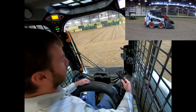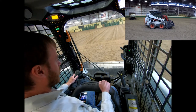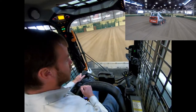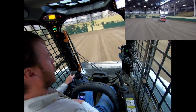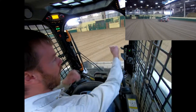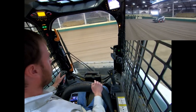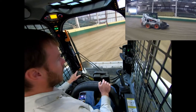This left joystick is what's going to drive us. If we're going to take off and drive, I'm going to make sure my bucket's not dragging the ground. As soon as I push this left joystick forward, you're going to see us start moving. We're going straight by pushing the joystick directly forward. As we want to turn, we move the joystick a little bit to the right to turn right, and to the left to turn left. It's a little different from the two joystick operation. Some wheels start moving forward, some start moving backwards.